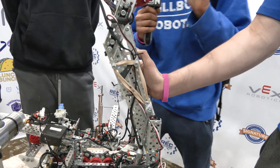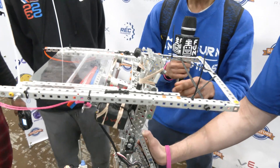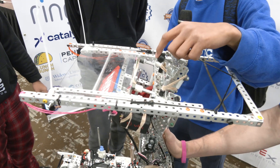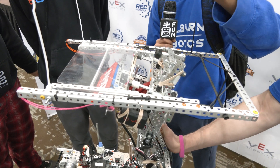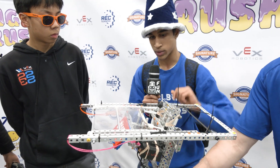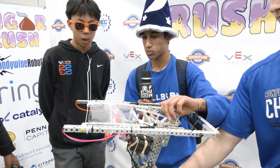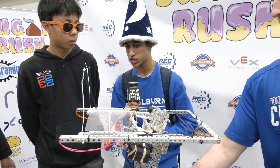We also have a kicker here. We went through a couple of iterations — originally we had a flex wheel, then a channel with a screw, but none of those really worked. We settled on a rubber stopper connected to a standoff. We experimented with how tall or short we wanted to contact the tri-ball and found that hitting it dead center was perfect. We also experimented with getting a lower or higher arc depending on blocker height: placing the tri-ball normally in the crevice gives a good arc, but placing it further inside gives a really high arc — enough to shoot over some of our sister team's walkers that we tested against.